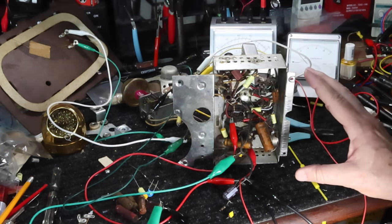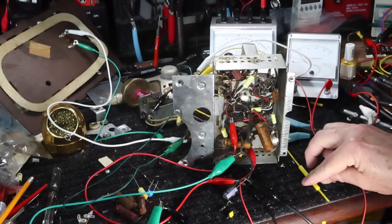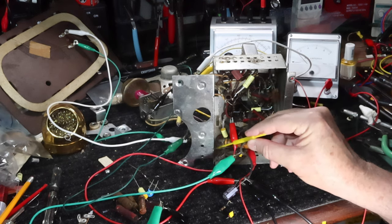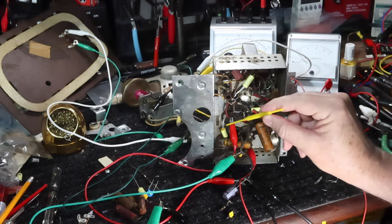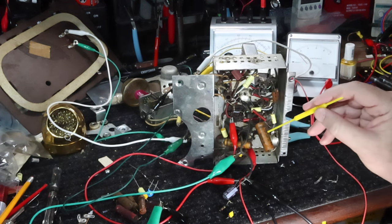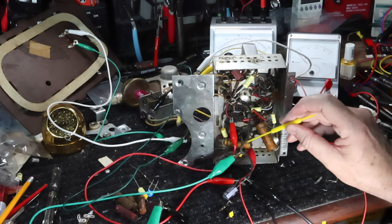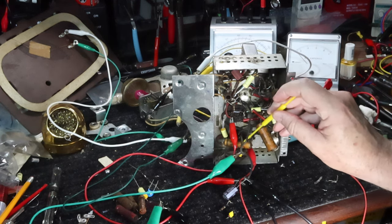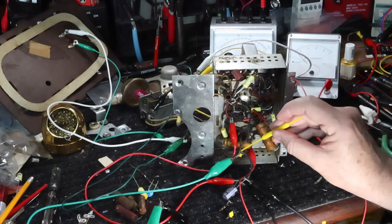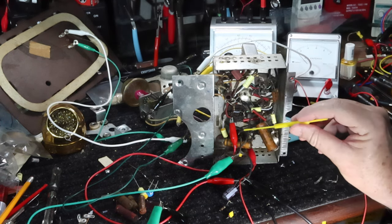I've done a number of them, though, that I had to go ahead and get out of the way without having checked it. I'm going to have an area of congestion that's going to be happening right in here. The power cord comes in down here. I need to go ahead and get this capacitor in. This is the death capacitor. It's just disconnected for right now. I've got a capacitor right here and a resistor down here that I need to change. And then this is where the power cord is going to come in, eventually tying onto here.